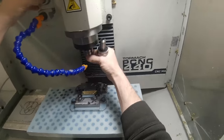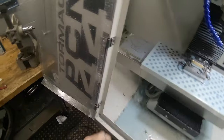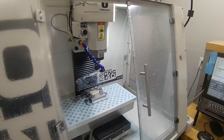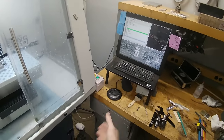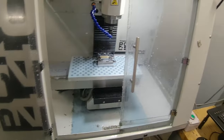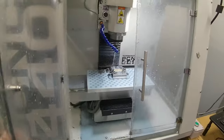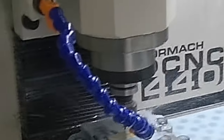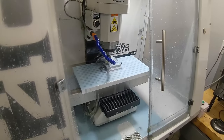I'm just going to switch out for the 1/32" end mill and just let it rip. Making sure the coolant looks good — yep, it's shooting right on the tip there. I think we can go ahead and start the next operation. That's just going to run out; hopefully it does its job. We'll catch back up after it's done running.